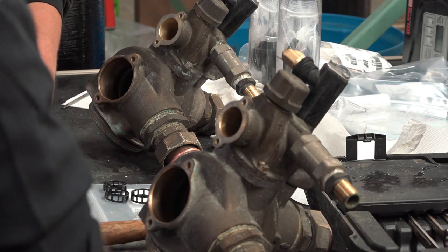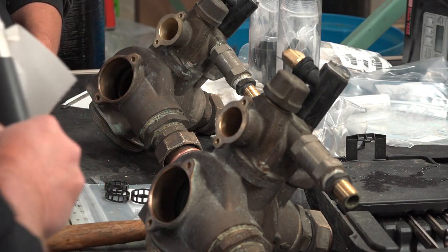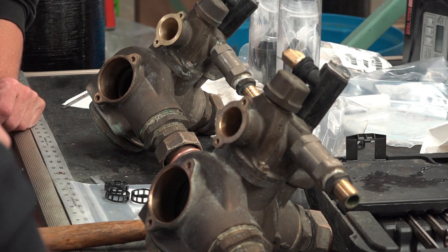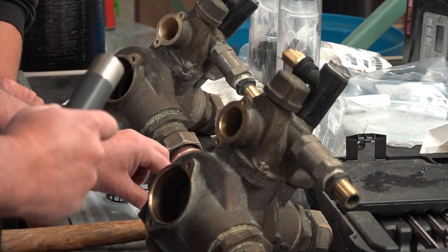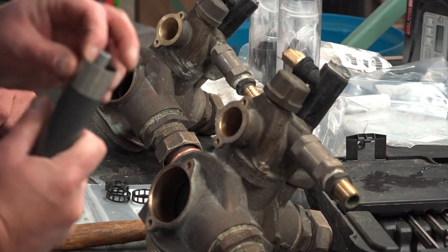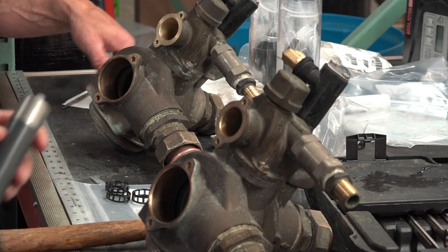Nice thing about these is they're actual quad rings. If they were O-rings, I think you'd see a lot of leaking going on inside the valve. Because they're quad rings, they're pretty forgiving. As you tighten down the valve, these compress and those lips become bigger lips. It bites right into the casting itself. So it's the white plastic, O-ring, then one of these, and then repeat the process.